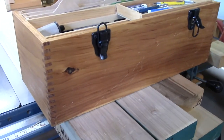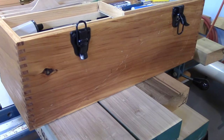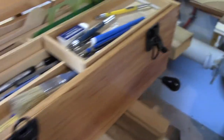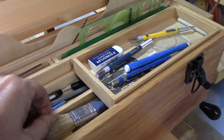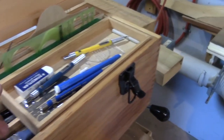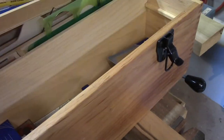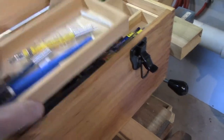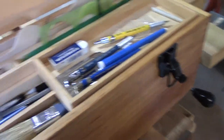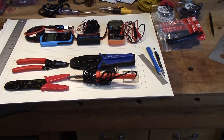I'm not going to use finger joints or dovetails - this is going to be a simple butt joint, glued and nailed. And this is what I meant by the dividing strip on the tool tray: you need something that you can grab so that you can lift it out. This half-sized tool tray is easy enough to move, but for the bigger one you want something you can grab and pull up to access the bottom. So let's mill some half-inch stock and get this thing going.